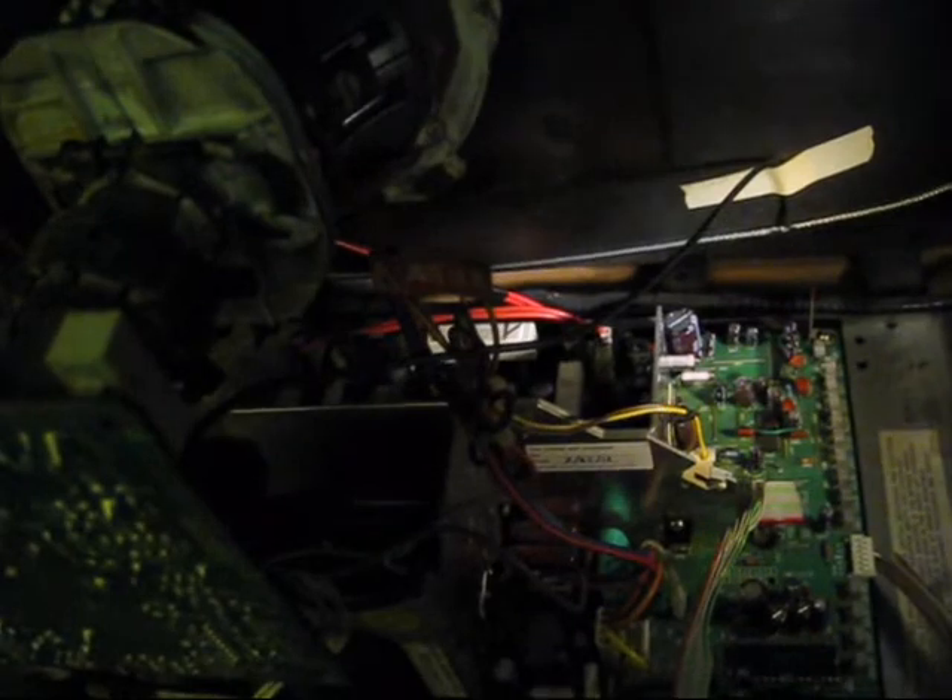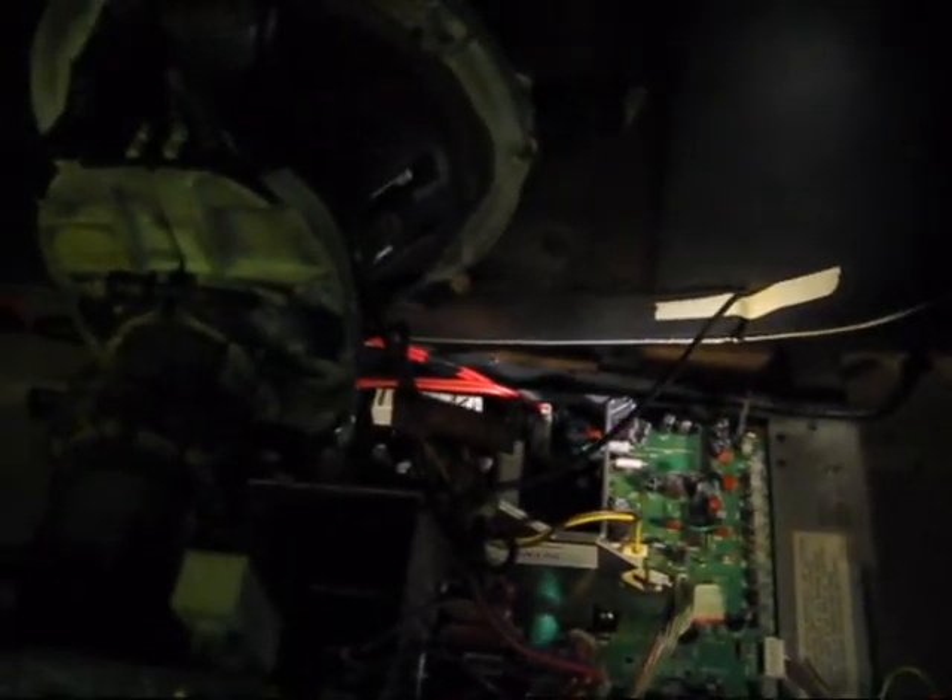which is to check the voltage at R967, which is the ceramic resistor up here. And that's what we are going to do today. The chassis is not plugged in and everything has discharged, which you should always do before you go poking around.